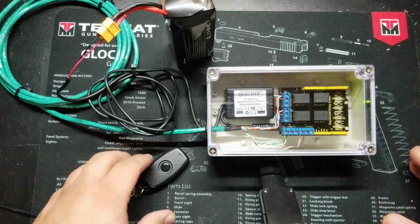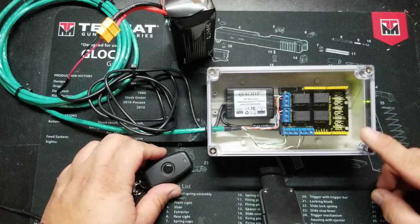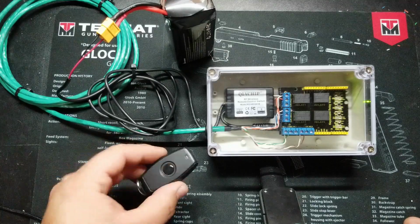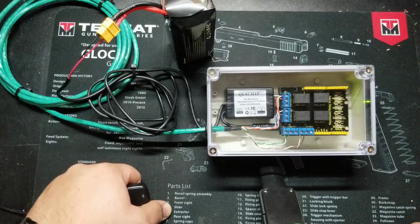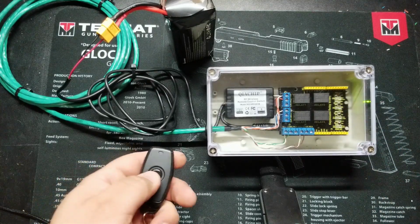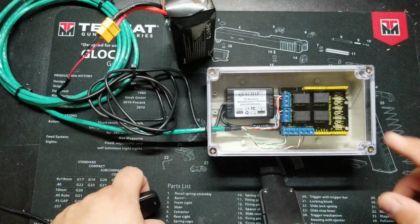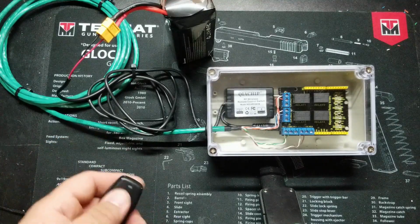So that was the whole script, and you'll notice a little glow right here that's a reflection from the Arduino, showing that the Arduino still has power, but in the script it has been told to go to sleep. So now the relay shield isn't doing anything, and the Arduino is just on standby. So now I can go ahead and power off the unit, and there's no power being delivered beyond the RF unit. So now I'll just simulate an interruption.